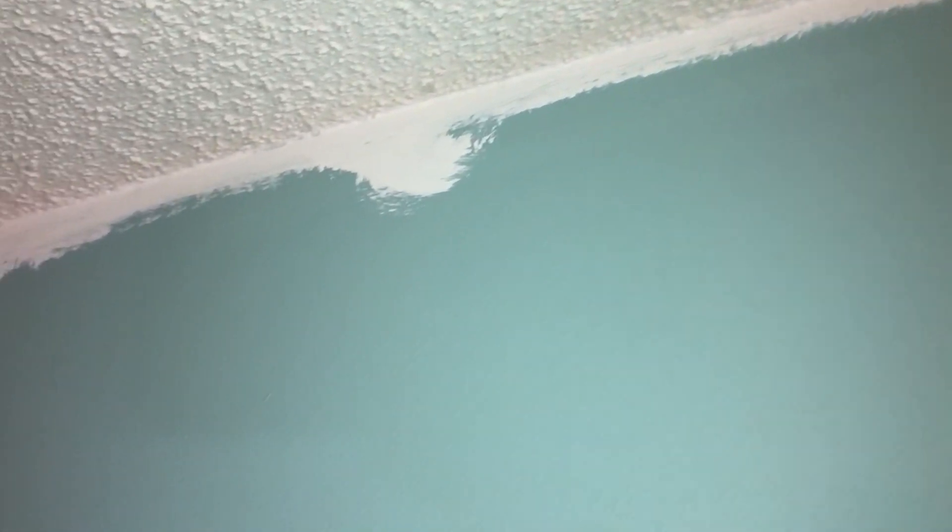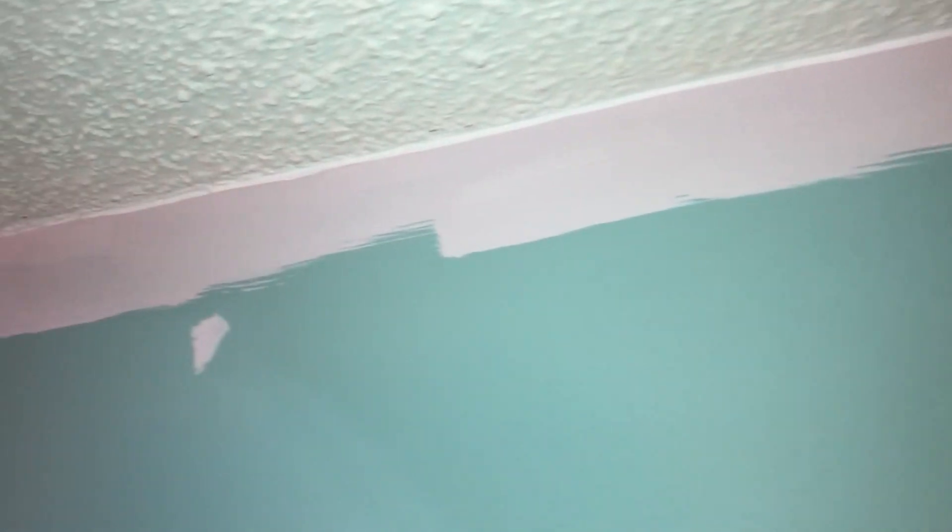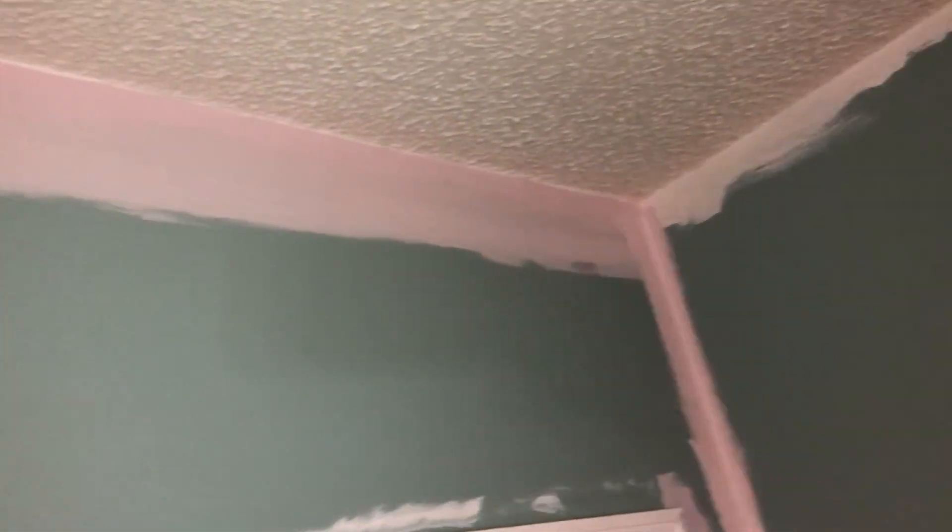A little project update. The other night I went around and put a little bit of ceiling white around the top edge. I'm not going to paint the whole ceiling because I hate this popcorn ceiling — it starts flaking off when you paint it and it still looks halfway decent. But by doing that, it covers up the original color. That way when you're running your new trim line, you have your new color going over white and you can make a nicer trim line. It'll look better when we get the whole wall painted.